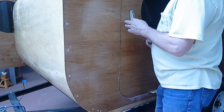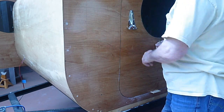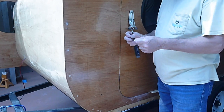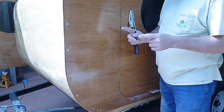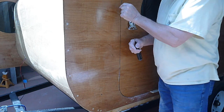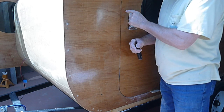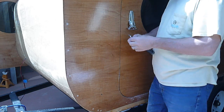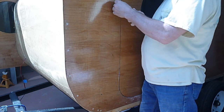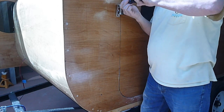Now, what I'm going to do is put all this together and get the things done I need to get done, and when I take it apart, I'm going to take one pipe cleaner. It looks like a little fuzz, twist it up in some wire about that long, dip it in some sealant, and push it up in those holes real good. Keep doing it until it just drips out of the holes. Make sure I got all those holes sealed from moisture, because anything made out of wood is just prone to rot eventually unless you keep it sealed really good.